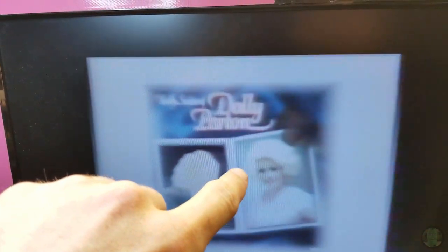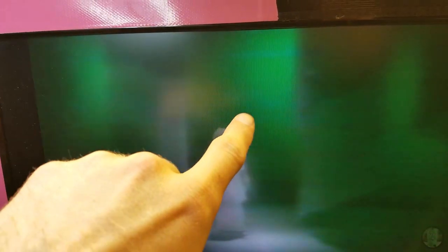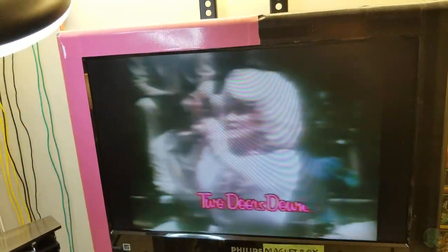Look at this sort of shakiness in the color on Beta 1 playback - you can really see it moving back and forth. Sort of adjusted so it'll work as good as it's gonna get, I think. Tracking for this recording has to be all the way to one side but that could just be the machine it came from - although Sony is Sony, right.